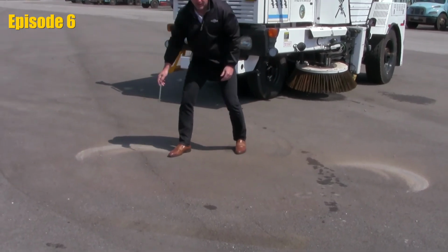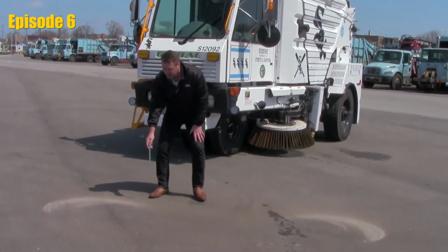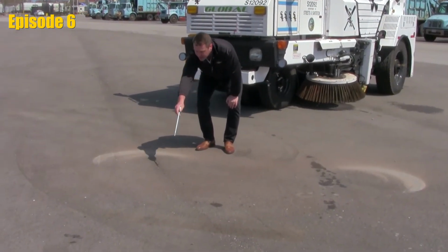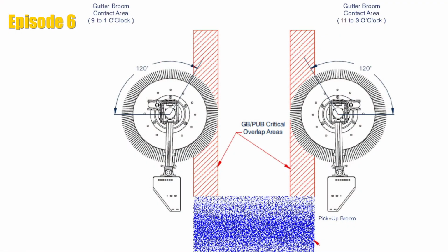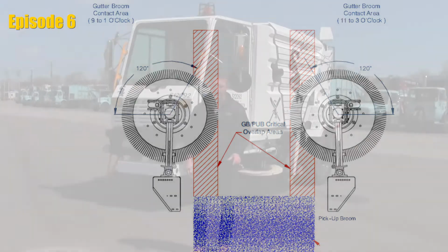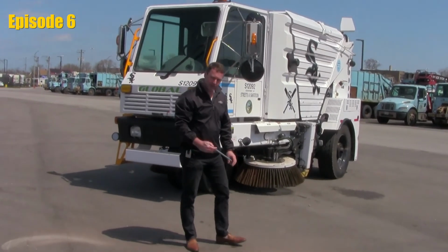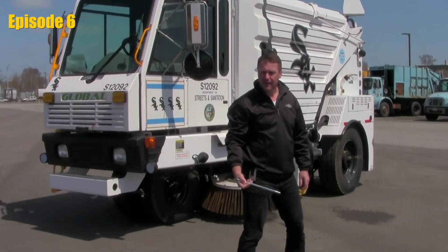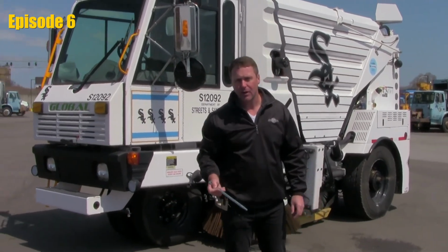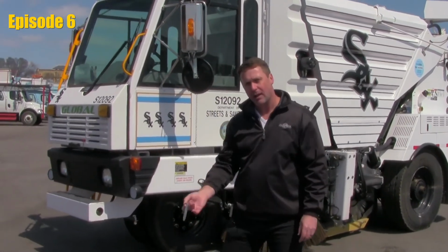We're very close. The last thing that I want to look at is that to the inside we see a bit of overlap with the strike pattern of the center broom. This will help to assure that we're not leaving that little trail because we have any kind of a space or gap. Now if you follow me over, for any reason, if we did need to adjust the down pressure of the center broom, either bringing it up or down,